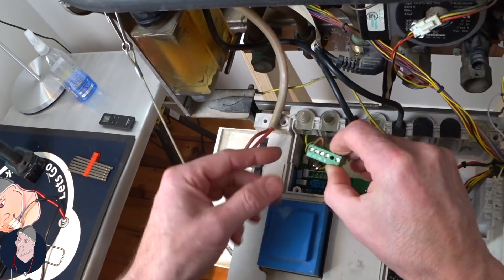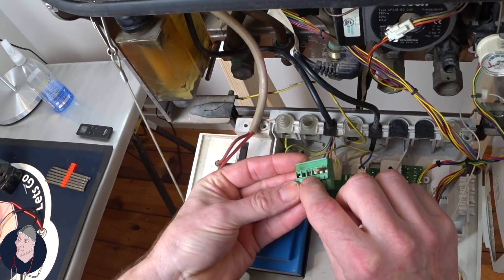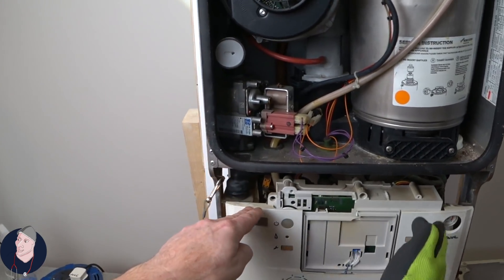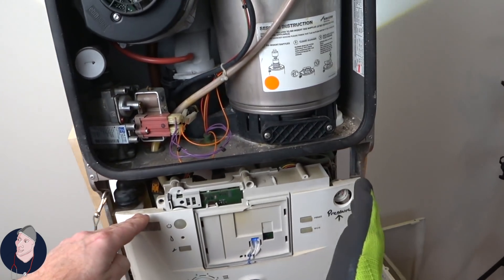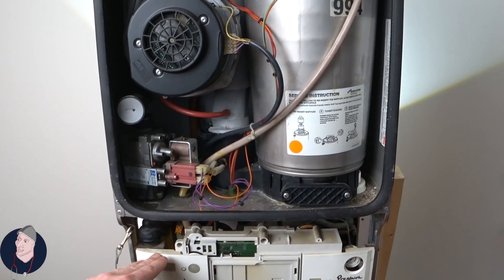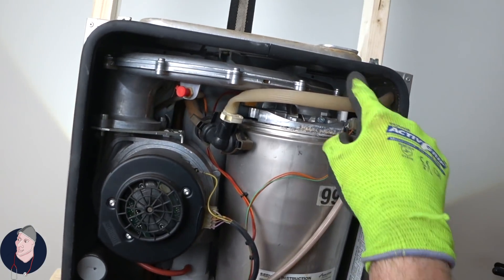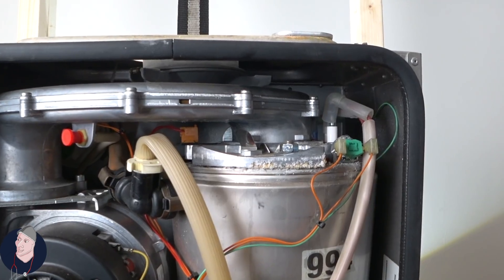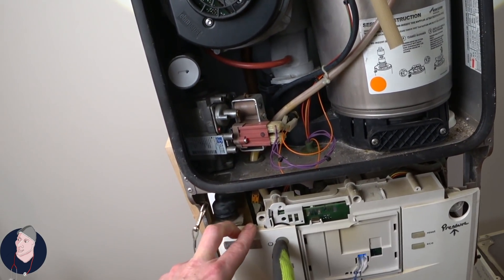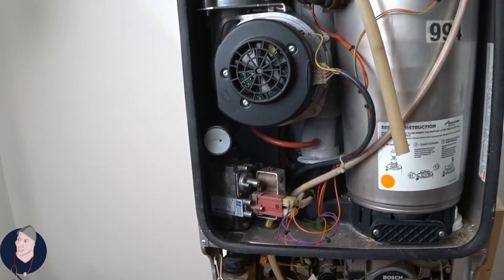This chock block comes out. In fact, to me that looks like they've cut it while it was still live. It's turned on — see if the fan runs. Pump's running. I can hear the ignition. I can actually see it. So the boiler is actually working. Miraculously. So now we've got to ask why he turned it off.